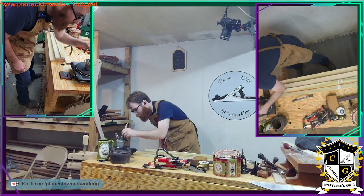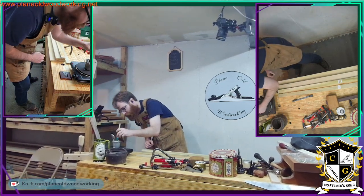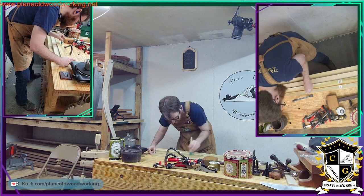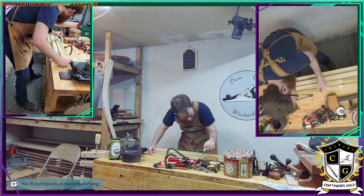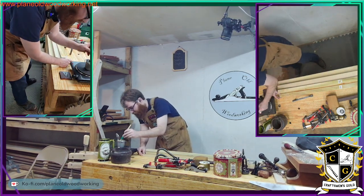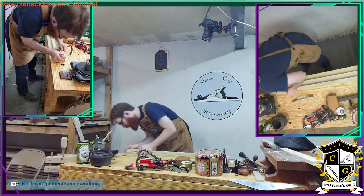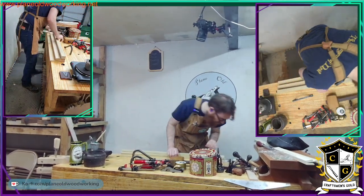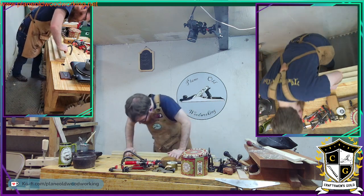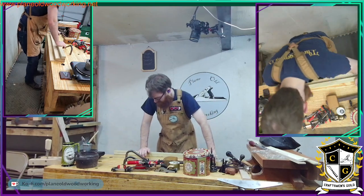And now that I'm not gluing 4-inch wide boards, I'm not running out of glue. Okay, so yeah, we're going to be able to run off the two pots of glue I made. It's a 1-ounce pot, so 2 ounces of glue. That's why I rarely ever bring out the Marietta, because even though it's a 1-ounce pot, do you see how much I'm able to glue off of this pot? I'm not even halfway done with the second pot. I just filled up the second pot when it was halfway down, so we've technically not even gone through an entire pot. But this is the thing that I love about hide glue: do you see me actually reaching for clamps? No. For that first one, yes, because I was trying to get a bend out. And it's still there, but I don't really have to worry about it. There's screws holding it in. But I mean, literally, I could do this.